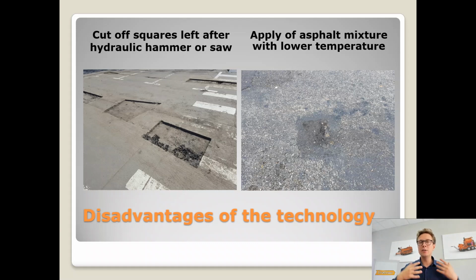at least on using the technology, at least using the thermal containers in order to transport the material into the job site, which makes us sure that we maintain the high and homogenic temperature of the mixture within the machines. So when we compact it, it remains flexible. We have the time to compact it and interlock the aggregates between the bitumen, and it all works nicely.